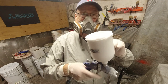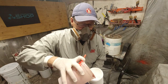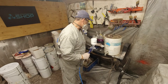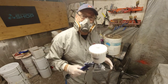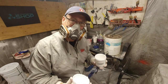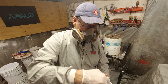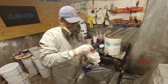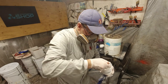So the next thing you do: you've still got some gel coat in the cup, so first get some acetone — about a third full — and just let that slush around in there a little bit, then put the lid back on. Let it work its way through the gel coat. We're going to clean this out in stages, not immediately. Very important — wear a mask and eye protection while you do this. Get your brush and give it a good clean out. That will get rid of the bulk of anything that's starting to set, because there's already gel coat starting to set inside that cup.